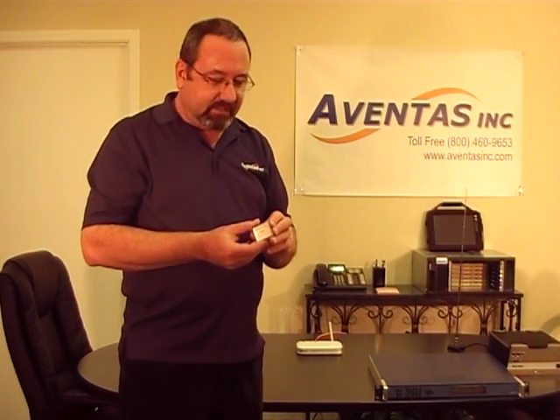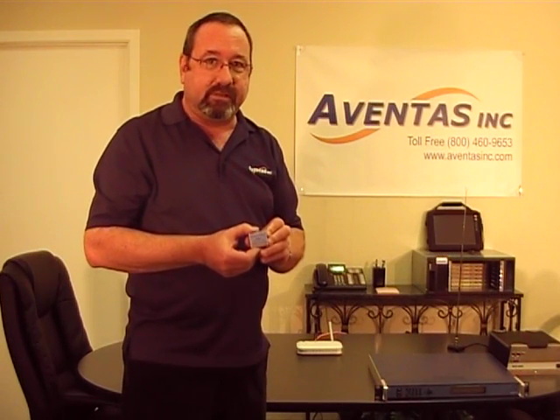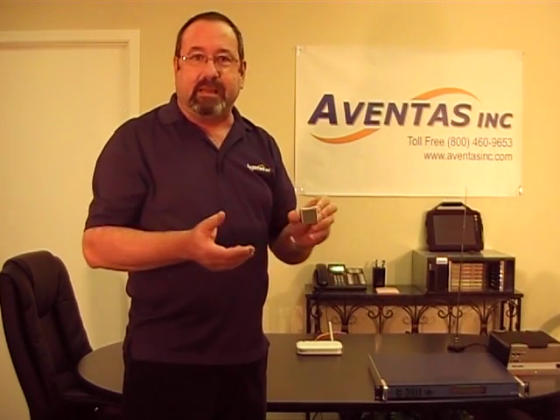It's a hermetically sealed unit. It has an RS232 interface for changing the low power mode and for changing some of the other characteristics of the clock. Speaking of the low power mode, when you are in low power mode you're well below 100 milliwatts in power consumption if you have a battery based application that you need to provide timing for.